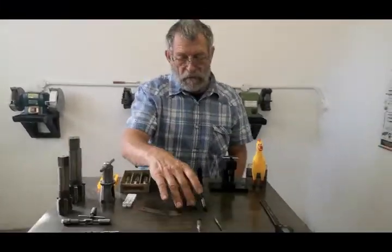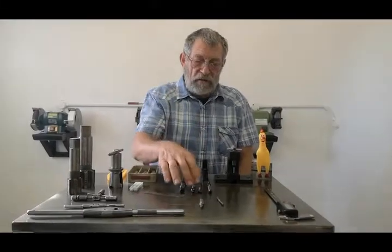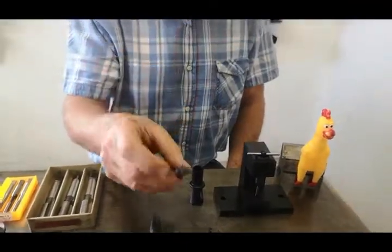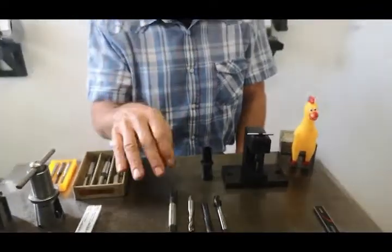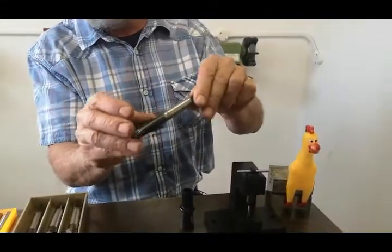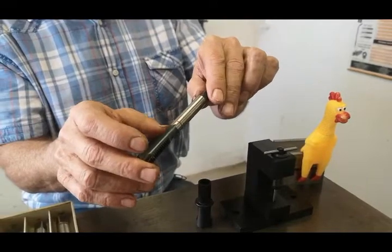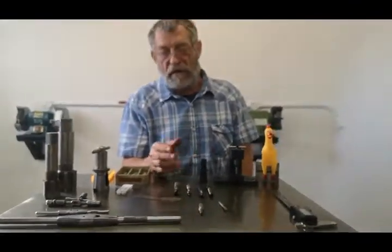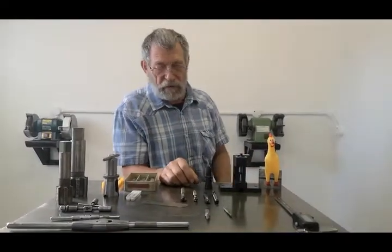When it comes to grades of taps, this black one is called a steam tempered tap, and the bright finished ones are ground taps. Black does not always mean steam tempered — with the coatings out today you've got gold coatings, black coatings — but in general a black tap is a steam tempered tap. I don't find them as sharp as the ground tap; I prefer a ground tap. Then we get taps with a little orange band, coded according to the application: whether it's soft materials, hard materials, or stainless steel.